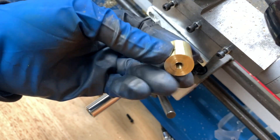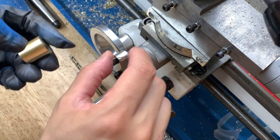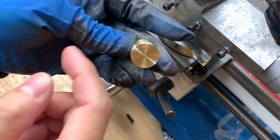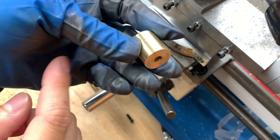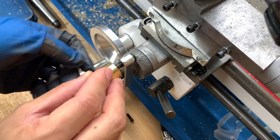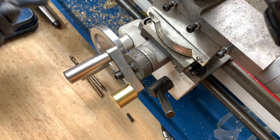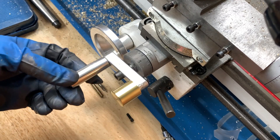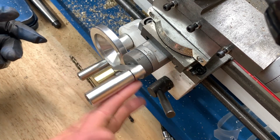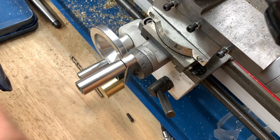Here's the finished product — the facing isn't the best, and it did come in a little under at 43 grams, with the bolt maybe around 2 grams, so just slightly under 50. I'm not going to make any more passes on the face since we'd lose even more weight. Got it all threaded, hit the surface with some scotch brite to clean it up, and now it just threads on by hand like so. The lever stays with the counterweight — it won't just drop and change distances. Easy fix, took about 10-15 minutes and a little bit of material.